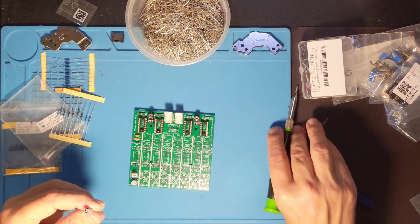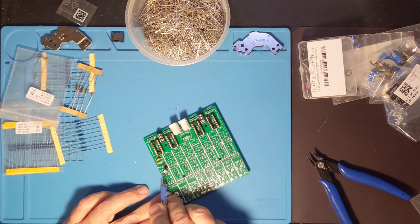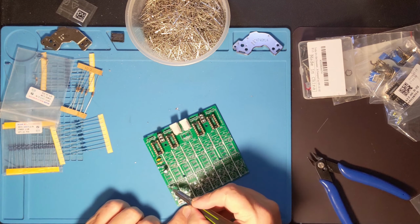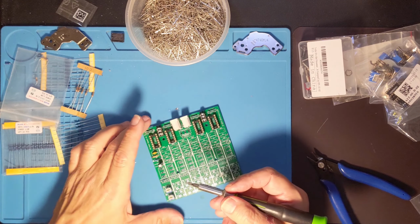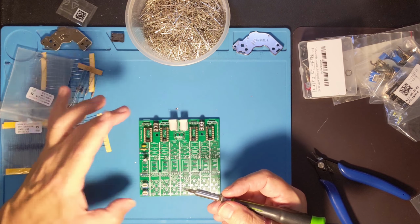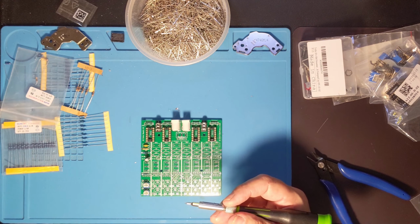And one more little tip for you. I've got test points right here and here. That's a test point to verify that the switch is actually flipped. And that is a test point for R1. So for the beginning of R1, the other test points down here I will define in another document. It's really just there if I need them for testing. And if you run into problems and you need to troubleshoot, there will be a document on my website where I put the circuit board design up for download, and also I have a 3D file. I'm working on a case for this, and we'll see if that works out. If it does, then I'll post that. Once I get it right, I'll post that. I don't want to post something that doesn't work.